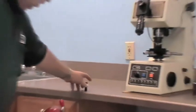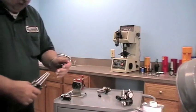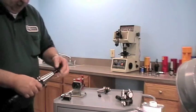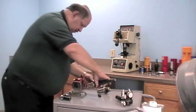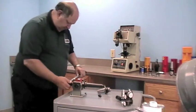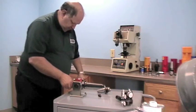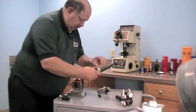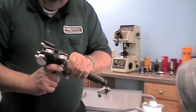Now I'm going to remove this from my test gauge and install our new high-torque retention knob — that's all I'm going to do — and install it at the same sixty foot-pounds. Then I'll take it out of our fixture and put our test gauge back on.